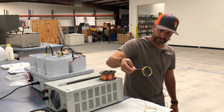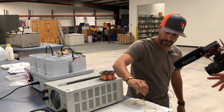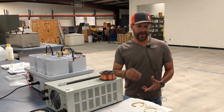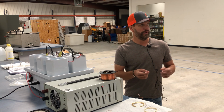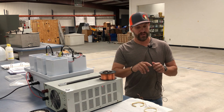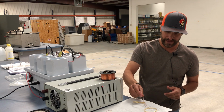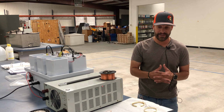And so where the wire is, because it's a little loose, it'll still plate. Something like an e-coat material, which is a resin-based material, anywhere there's contact will leave what we call a scar. It just will not put product. Plating will still penetrate and you'll still get plating. Only if you wrap it really, really tight around the area are you going to keep it from plating. So it's important that it be slightly loose, just a little bit loose, so that it can penetrate in behind that contact point.